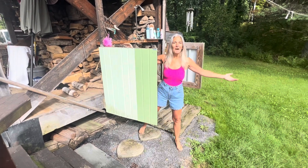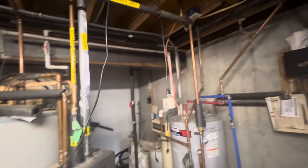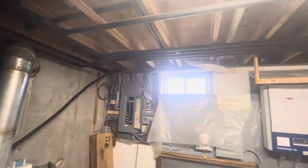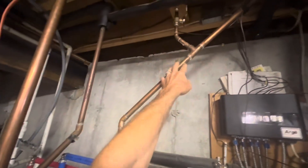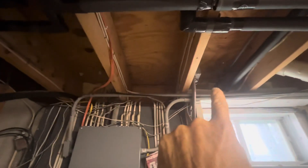It's the bomb. The most difficult part of this project is tying into your hot water line and running that line outside to a hose bib. So here we have our hot water heater and we've got a copper line — we just tied in, put a valve on, ran the copper line out through to the rim joist.